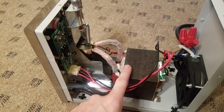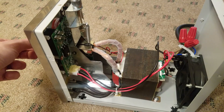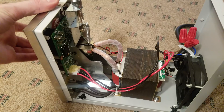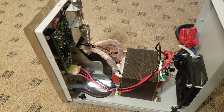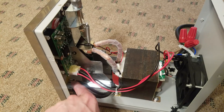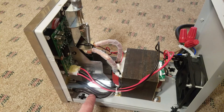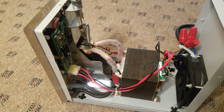The way this works is this is your output transformer, and there's a lead that goes up to the top. This is the front pedal — when you push cells up from the bottom, it flips the switch and the current flows up these two leads into your front probes and spot welds your battery. There's also the option of plugging in the welding pen, where these two wires come in down here. This is actually one single wire that goes straight up through here to the top — one single piece. The output from the transformer is just soldered on, and it's actually not even soldered on very well — it's kind of just tacked on a little bit.